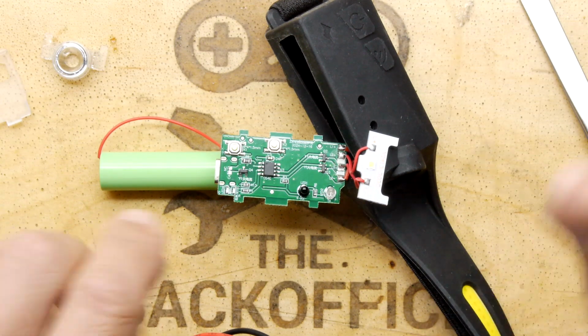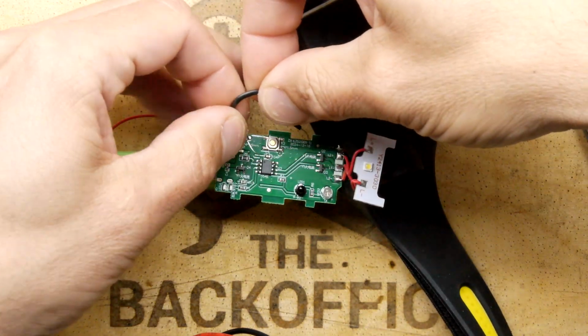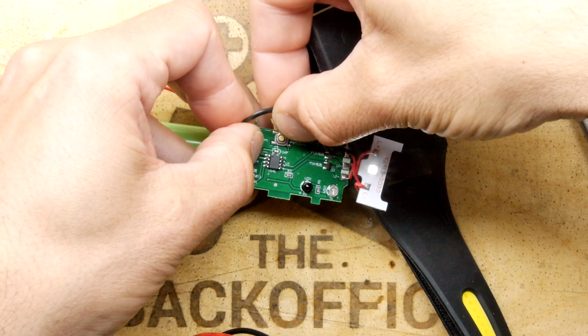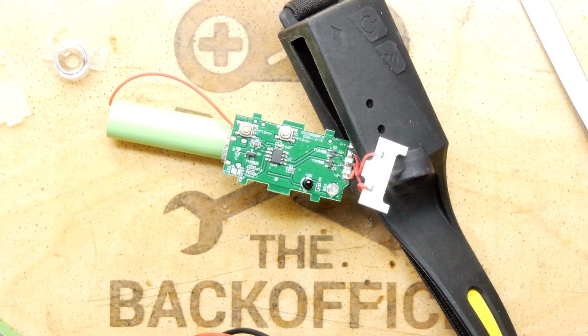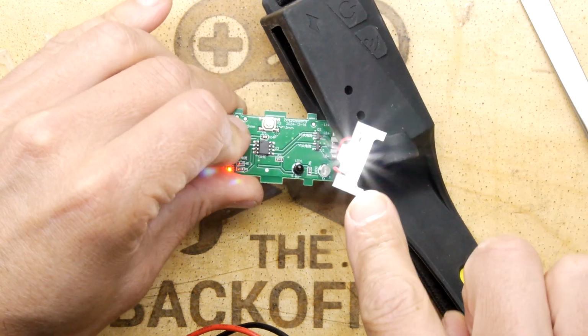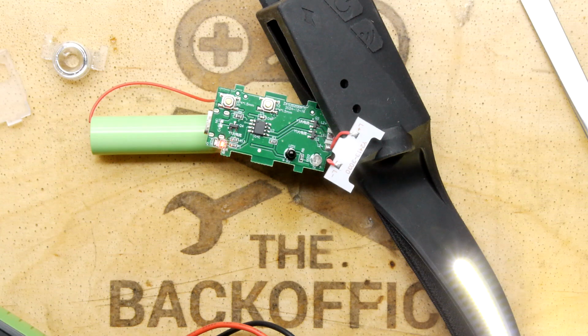Okay, we have it running. We know that this chip would have 3.5 volts there, so I'm going to jumper basically onto the base. Oh, oh no, I blew out the transistor. Now it's permanently on. Oh no. But yes, that's how it controls it, those two lines. Really, you should only have about 0.8 volts, so we really did overcook this. I'll see if I can swap that out of something.